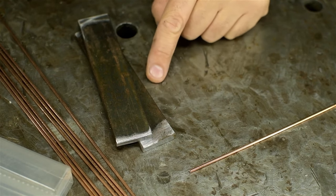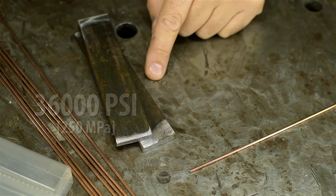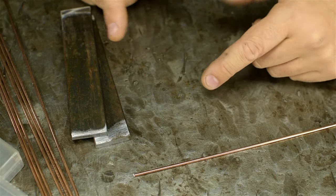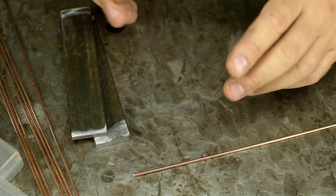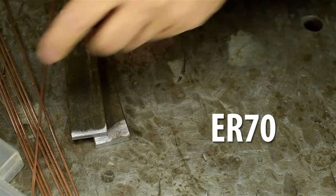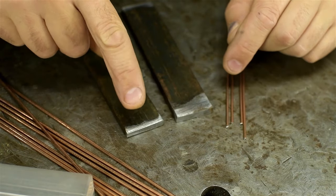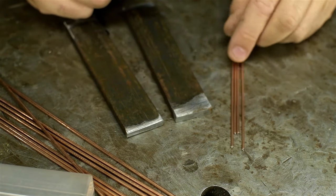In terms of strength, mild steel has a yield strength of about 36,000 PSI. If you put anything over 36,000 pounds per square inch on it, it'll bend and not come back. You often hear that welds are stronger than the base metal — words thrown around like harder, tougher, stronger. But regular welds are not harder. They are stronger if you did it right, but technically they aren't harder. Your usual ER-70 rod gives you 70,000 PSI versus 36-ish, but it's just as soft.